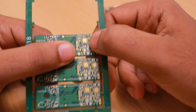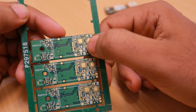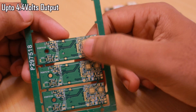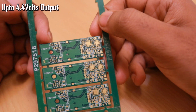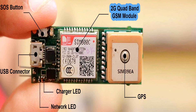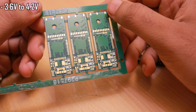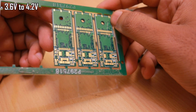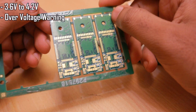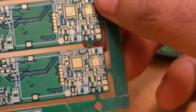This chip has a thermal pad below it, but in spite of that it's getting too hot, and that was the first reason I had to change this chip. Also, whenever the charger is connected this device will give up to 4.4 volts. That 4.4 volts is no good for me because the circuit has a GSM module on it, and this GSM module can only run from 3.6 volts up to 4.2 volts. Anything above 4.2 volts and the GSM module will turn off, giving an overvoltage warning.